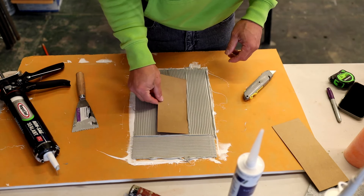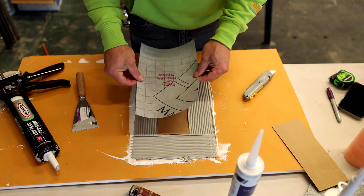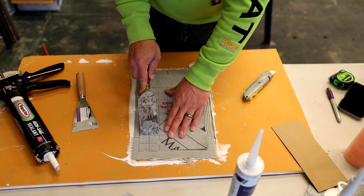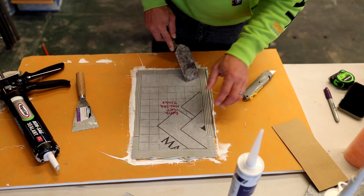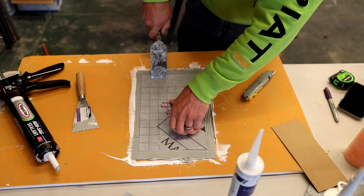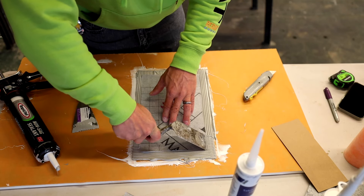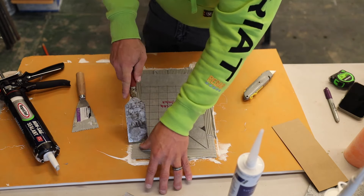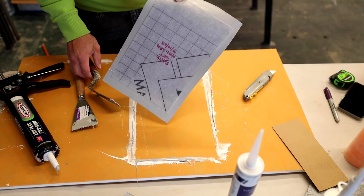Piece of cardboard going in — the Rapid Set. Make sure I got it labeled correctly, Rapid Set with today's date. Put it on over the middle. This isn't quite a 2-inch overlap, it's like an inch and three quarters, but good enough. And the Rapid Set is ready for the water.